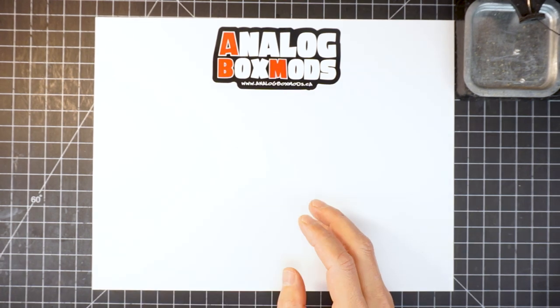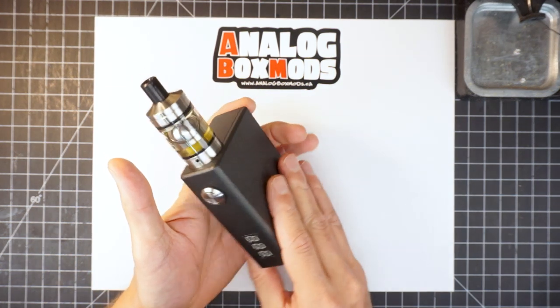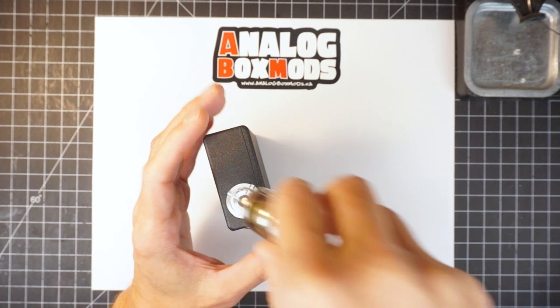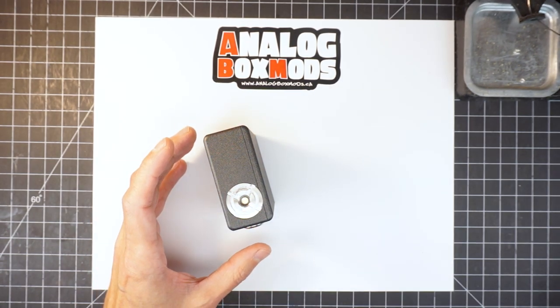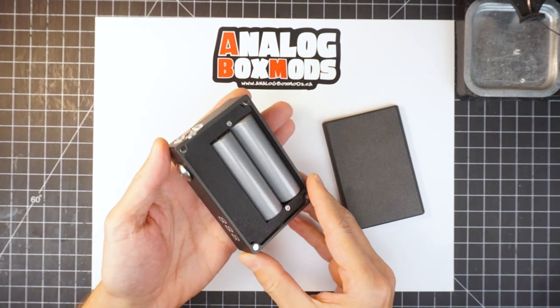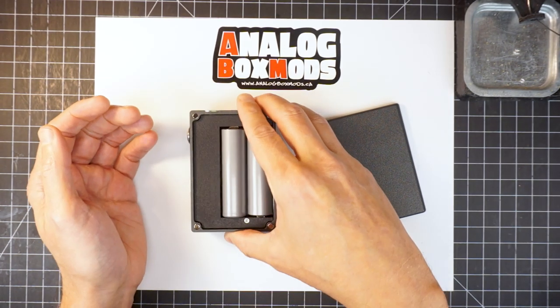Now I won't hit it too hard. The atomizer there isn't really designed for the high voltage that's going on here with the series unregulated. Kind of like a, I guess, noisy cricket setup, series unregulated. But that works. So recap, an unregulated MOSFET mod, dual 18650, in the ABM-2 enclosure with the gunmetal powder coat finish. 3D printed battery sled and top cover. Super clean. Batteries are in series here. You're getting 7.4 nominal volts output.